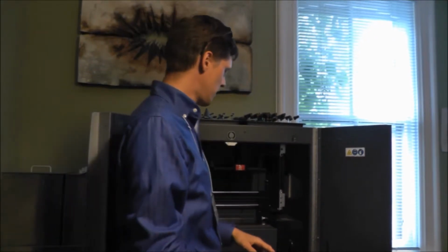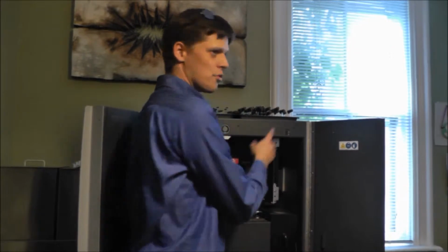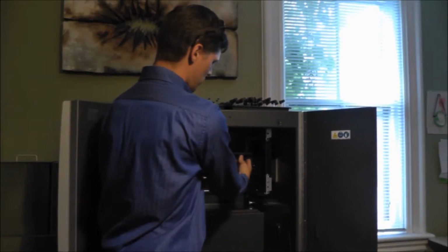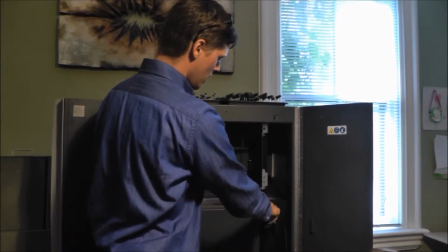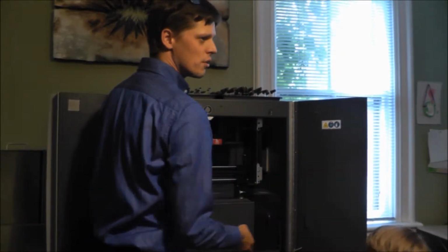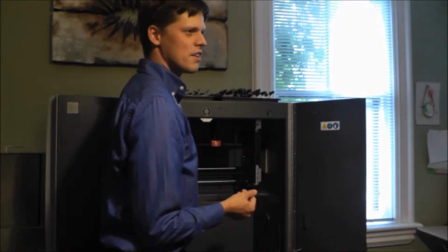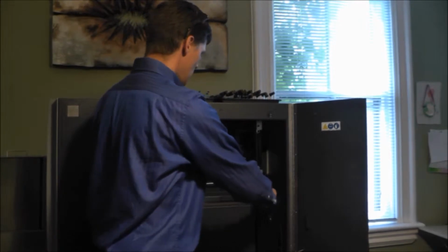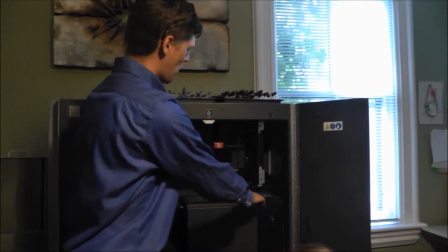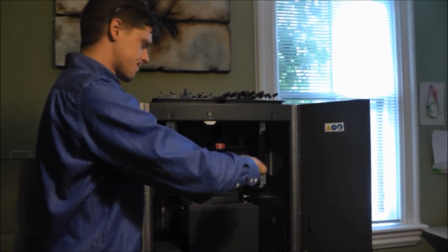So what then happens is, when it goes to build the object, you hook up a little pad that goes in here. You sort of saw the pads there in the workshop with things stuck on them. They attach to the bottom of this device. And then this is the cartridge here that holds a UV curable fluid. So it's like a sticky, resiny kind of, smelly kind of plasticky stuff. It slides out on a film. It's got a little pump and everything here, and an arm comes out and draws out a layer of film with the goo on it.